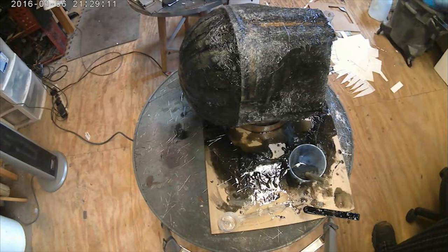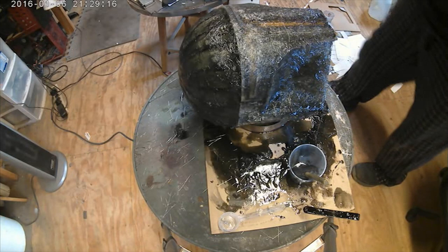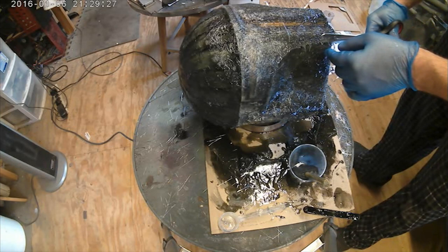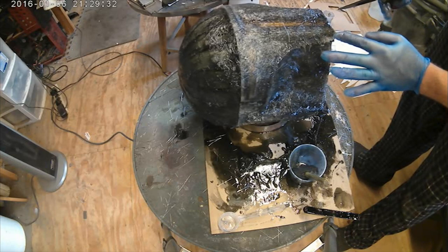I didn't want to make them too thick, so I used a thinner fiberglass on them. And then the paper template areas, I wanted them to be strong, just like the dome. So I used the 1.5 ounce on those areas. And that way I only had to worry about putting one layer of fiberglass on each. Remember too that the cardboard areas were already very thick and hard from the first two applications of epoxy resin that we put on at the very beginning.